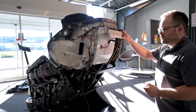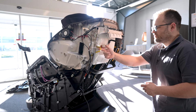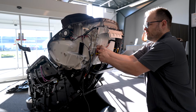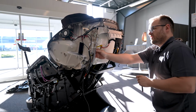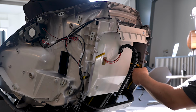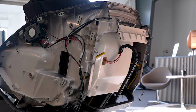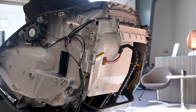The last big piece for the head side, the way you remove it, you have to unplug these two, like this. And then there's 3 screws on each side from the inside here. They are located in a pattern, like this, and also on the other side. And the 2 last ones are located up here. When you take these out, you can remove the whole assembly.